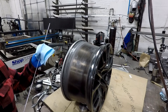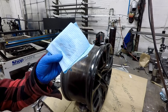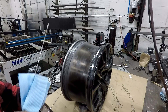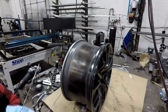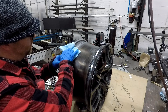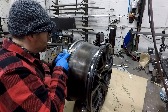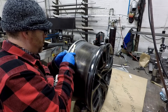I like to prep my filler rod. I'm just using 4043 filler rod here. Wipe it down with acetone - as you can see it does pull some stuff off of it. I like these pro-level blue shop towels; they're available at Wally World. They tend to not fall apart and fray like the standard blue towel. With acetone, regular shop towels start delaminating and you've got paper particles all over your work. You can always take a dedicated brush for aluminum and go over it as well.